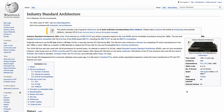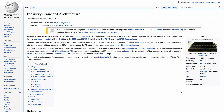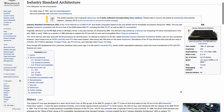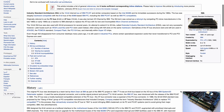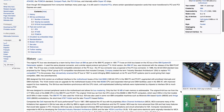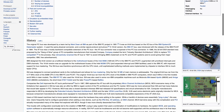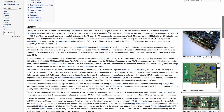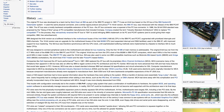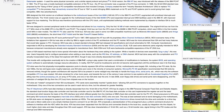In my research I was quite surprised to find that ISA doesn't even have a proper final published standard. There's a draft known as the IEEE P996 specification, but it was never formally finalised, which probably explains some of the weirdness around it including clock speed. It's generally accepted that ISA runs at 8MHz, with machines utilising faster system clocks adding wait states where the CPU basically waits on every cycle for the slower components to catch up. But some IBM clones did indeed clock their ISA bus at 16 and even an eye-watering 20MHz, so you'd think that 10 wouldn't be a problem.